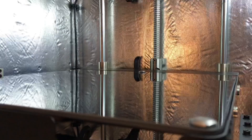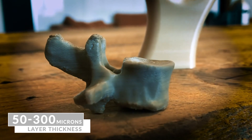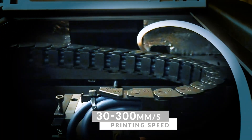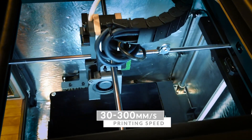For functional materials, we have a huge build volume with this printer, and you also get full flexibility on the layer thickness — from 50 microns to 300 microns. And printing speeds as well, from 30 millimetres per second, really slow for some materials, up to 300 millimetres per second.